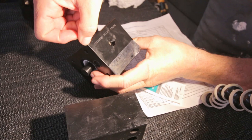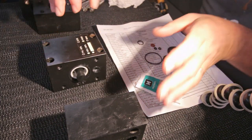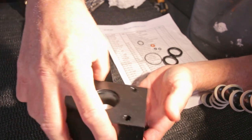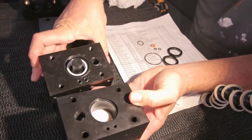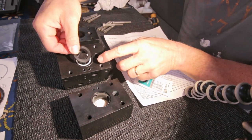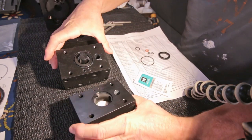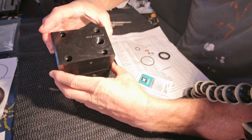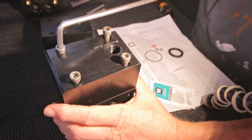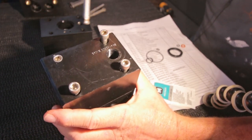So this is the block you start with. This is where the pressure relief valve is, right? That's on the front side of your Clark pump. So like this, and then you have those other two blocks, and there's holes in it that have to line up. So theoretically, you can put it like this, but then the holes don't line up and it doesn't work. So watch out that you line up the holes, right? And then not to forget this spacer, which I reused because it's not in the new set. And then just bolt them together. A little bit of grease. So as soon as you feel it's neatly going into the thread, then you can turn them further. Always do across: this side, this side, this side, this side. Every time a little bit tighter.